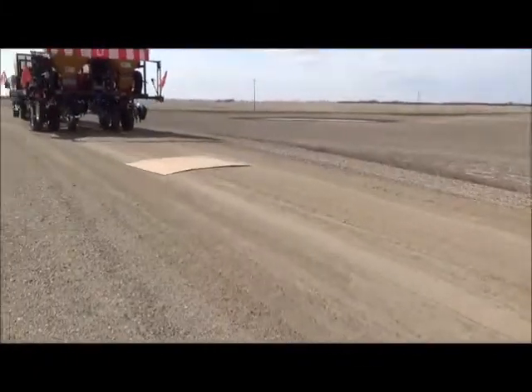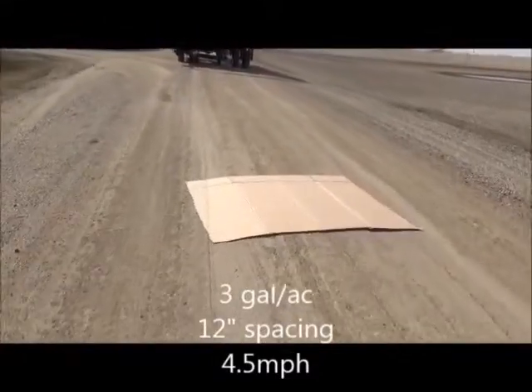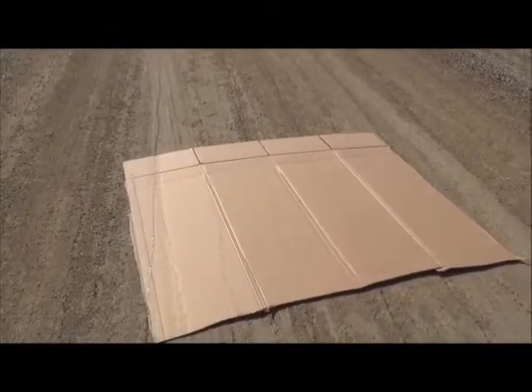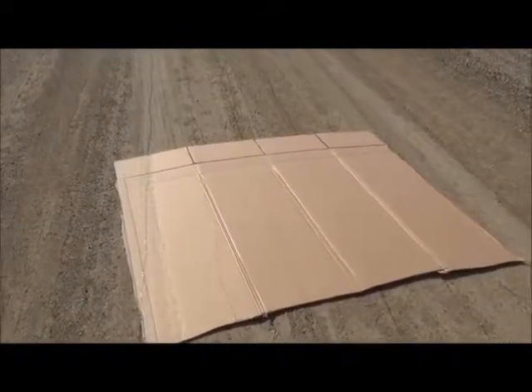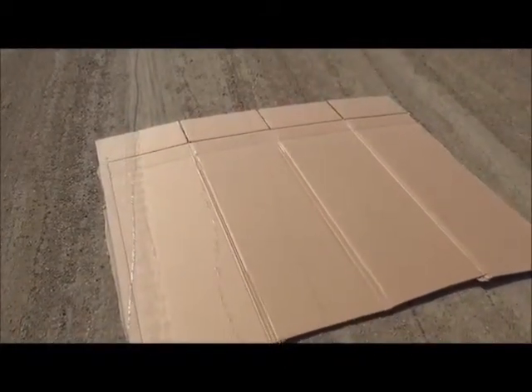That's just passed over the cardboard — we'll take a look at what the stream is like. This is Alpine being applied at three gallons an acre at 12-inch row spacings. You can see where the two outer shanks that we held up produced a basically continuous stream of product.